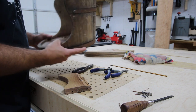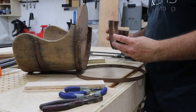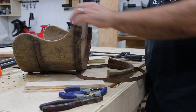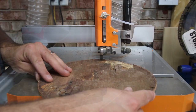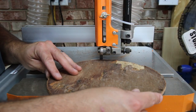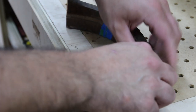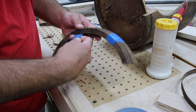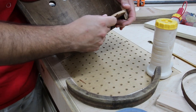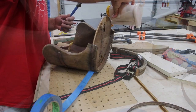I'm going to turn the seat support 90 degrees and use some fresh wood on that. The front part of this rocker has broken — I think it's because there's not a lot of material there and the wood moving over time just cracked it. Good thing the band was there or it would have fallen off a long time ago. To be safe, I'm going to take the seat support over to the band saw and cut it down just a little so it sits back in there better and allows that front piece to sit in place. Through this process I dropped the piece and it broke into three pieces, so I glued and taped it back together, let it dry overnight, and it held up just fine.